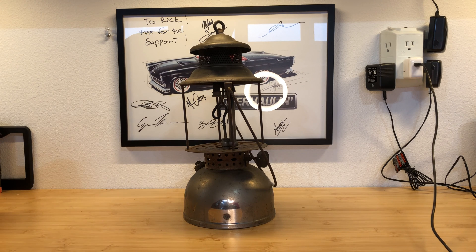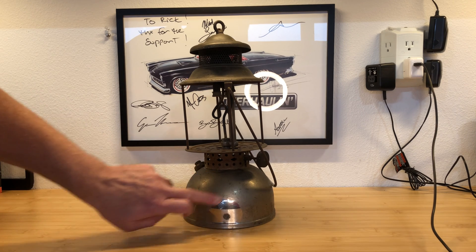This is a great reminder: when you go to polish nickel, especially when it's old and crusty like this, don't just start polishing. Use a mild acid solution. I use citric acid — about one teaspoon per liter of water. You can use white vinegar, or you can even use ketchup. You can make the solution in a pot and submerge the whole fount, which is great if you need to get solution inside to clean it up. Or you can soak paper towels, wrap them around the outside, and leave it for anywhere from 10 to 20 minutes. Mild acid shouldn't hurt the nickel if you don't leave it on too long, and you can see how easily it takes this off.